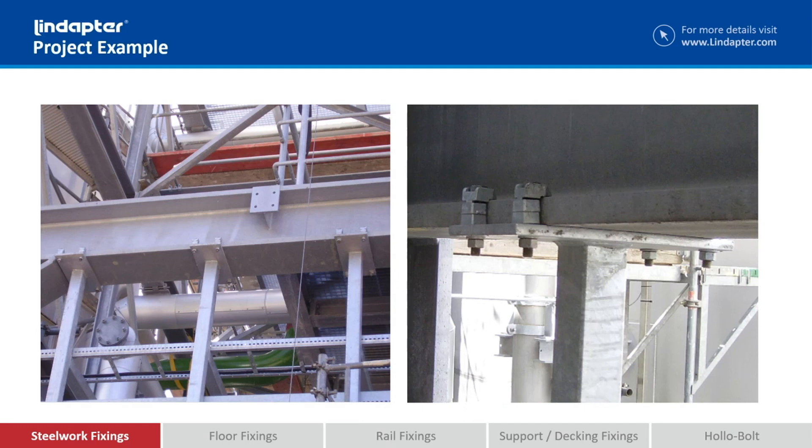So we came up with a system where you could expand the width of the plate and use the clamps to just bolt through the plate and clamp it straight onto the steelwork. You may remember I mentioned packing pieces — if you look underneath the tail on the right hand side you can see those in action. You've got a type A Lindapter on the top and then two packing pieces which allow the type A to clamp onto a thicker flange.